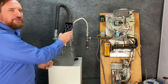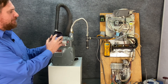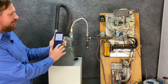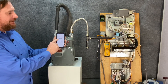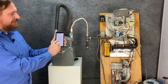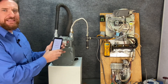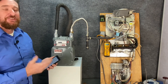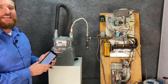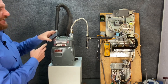There is another method using an app. In this app I can put in my dial size — two cubic feet — then put in 10 seconds, hit done, and it tells me 720 cubic feet per hour at 756,000 BTU, and also gives a therm rating. What I like about the app is it's quick and I don't have to carry a chart. What I don't like is it's not giving me my BTU rating directly, so you still have to factor in your local BTUs per cubic foot to make the adjustment.